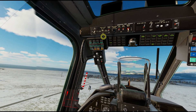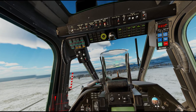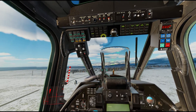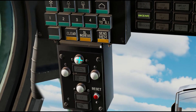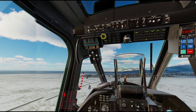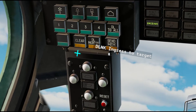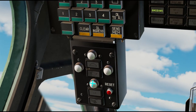On the left-hand side here we have our laser warning system. If we have a laser bounce off our aircraft it will tell us the direction of where it is being fired from, and it will also tell us 'warning, under attack.' Say we had a laser directly in front of us hitting our aircraft — this top light would light up. If we were being lased from our left, 9 o'clock, the left would light up and so on. If we were being lased from diagonally to our left, probably about 10-11 o'clock or so, both of these would light up. Same if we were being lased from our 7 or 8 o'clock, both of these would be lit up.